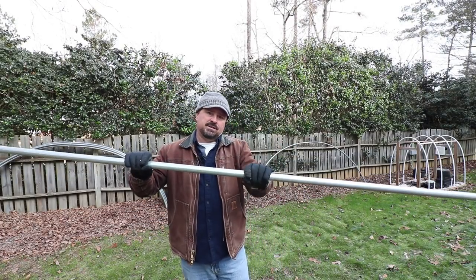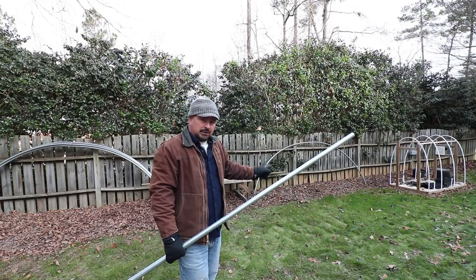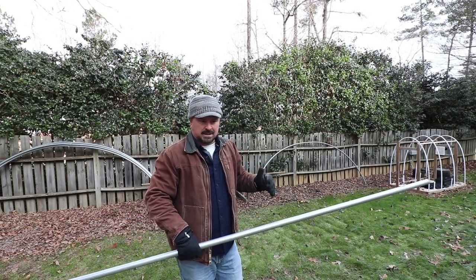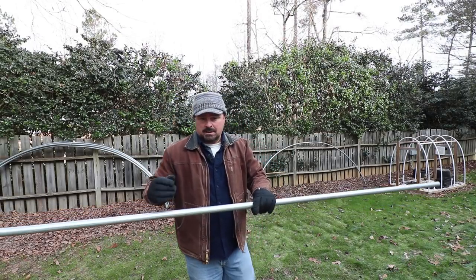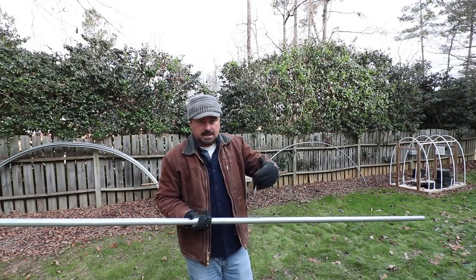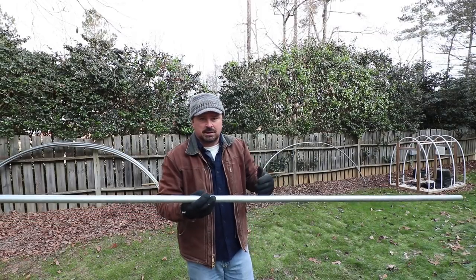These cost about $12.50 a piece, making about $25 for one 12-foot hoop because I'm putting two pieces together and when bent I'll end up with about a 12-foot wide hoop. That pipe bender comes in a version that makes a 20-foot wide house — I think you'd need three pipes for that. I have the 12-foot wide version using two pipes at $25, and there's a smaller version for very narrow tunnels about six feet wide. Each of these hoops is going to end up costing me $25 in materials. For the cold frame tunnel in the next video I need four of these plus a support piece, so all in all I'll have about $150 in this cold frame. I'll be able to put it away in a garage, hang it on a wall, and bring it back out twice a year — and as long as I don't let six inches of snow land on it, it'll last forever.